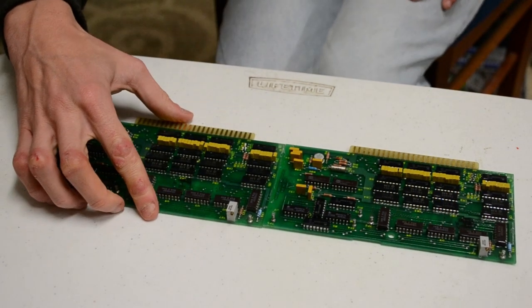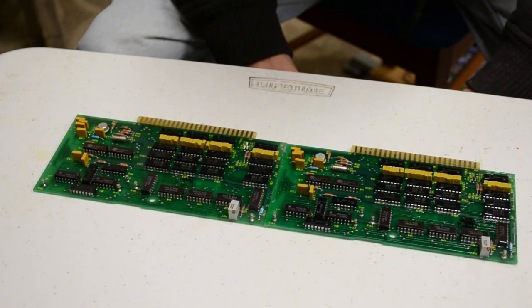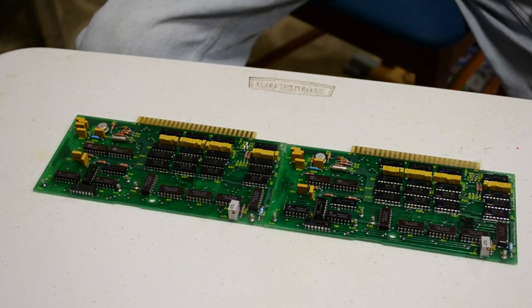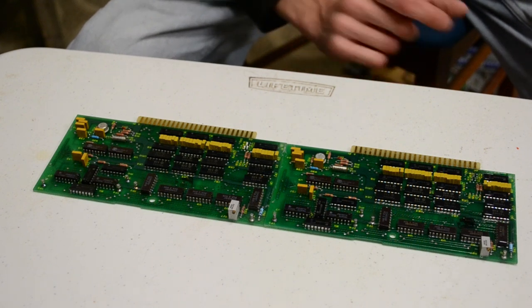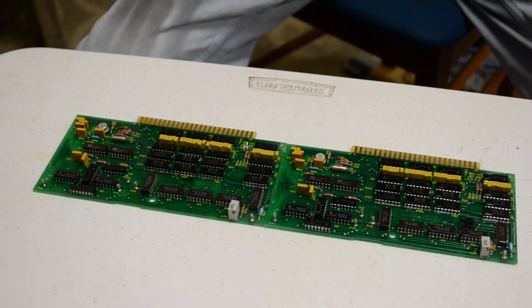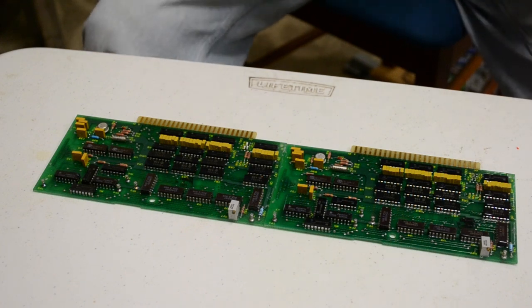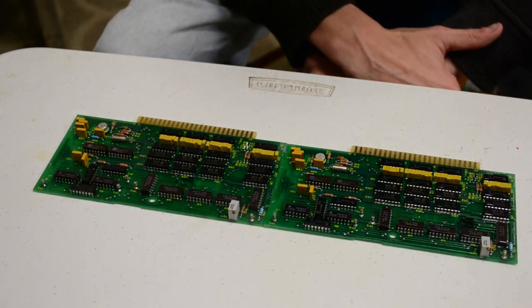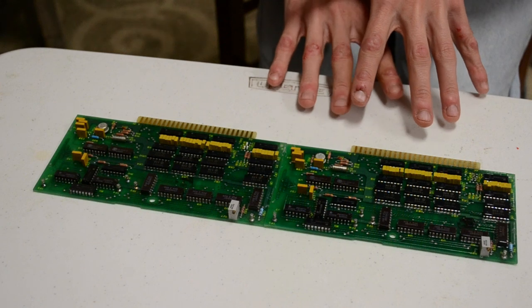So these two are the sync digital multiplexers. Basically, all the data coming in is 28 volts AC, but at 12-bit words. So basically a single word, so you've got 8-bit computers and 16-bit computers and 32 bits, and these days the words are 64 bits. The data being sent was 12 bits. And what these do is these multiplex all those different signals coming in.